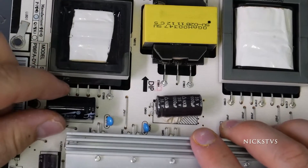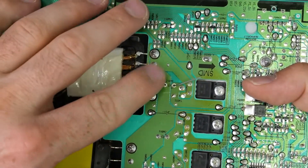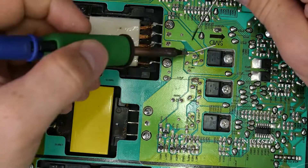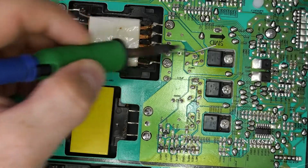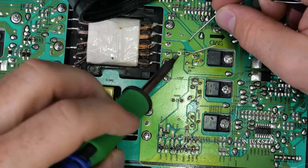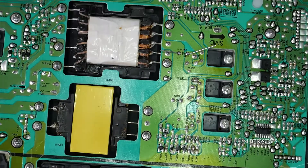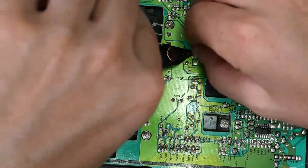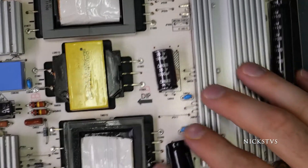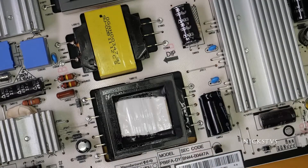We'll go ahead and lay it down. This capacitor isn't quite exactly the same size, but that's okay — it's still going to work. I'm just going to bend the leads out to help lock it into place while I solder it down. Then clip the excess and double-check one more time: our negative is over on the left side, which is exactly how it was originally and as indicated on the board.